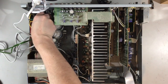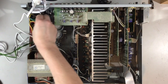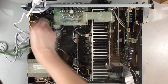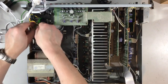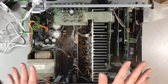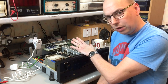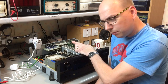Please don't attempt these kinds of things if you're not familiar with this kind of work. I'm going to attach that to the fuse holder, and I'm going to run this amplifier off an isolation transformer just for extra safety. I'm going to ground the chassis as well, just in case anything happens. Let's see whether the bulb lights up or not.